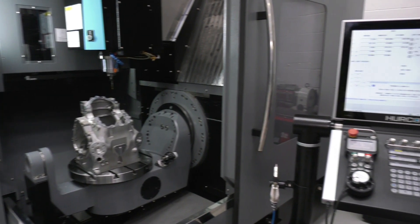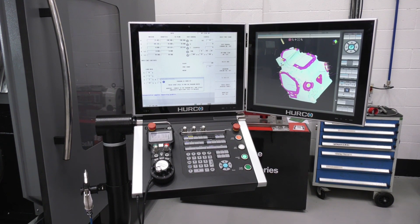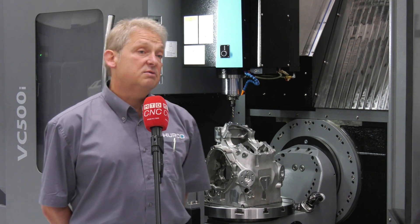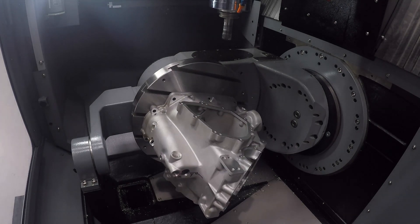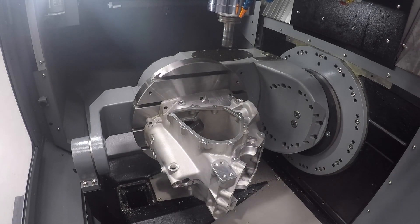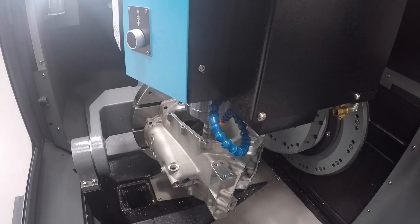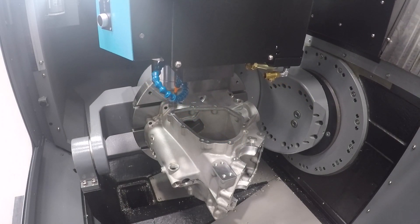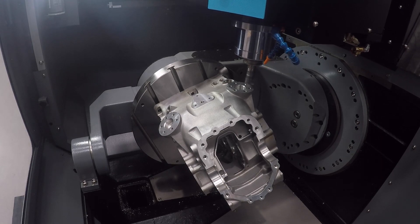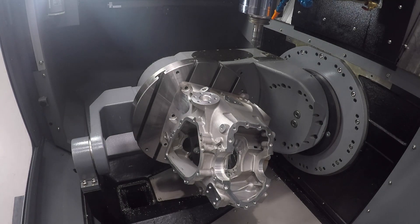What about the actual application that you've got on here? Talk me through what you would be doing on what is a gearbox component. A customer has come to us and they want some reworking done on this — they wanted some helicoils put in some holes. So we've actually scanned this component in just to get an STL model as a reference. We've programmed the part conversationally on the control and we're able to see the machining that we're doing programmed onto the model. We don't create the STL on the machine — it's created by an outside source — but we bring the model into the machine just as a reference and then we program it conversationally, and you can see that you're actually machining into the model.